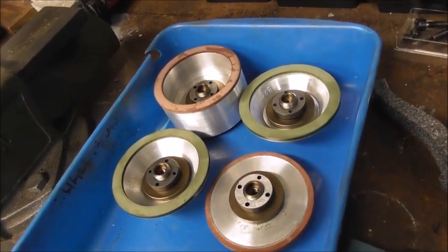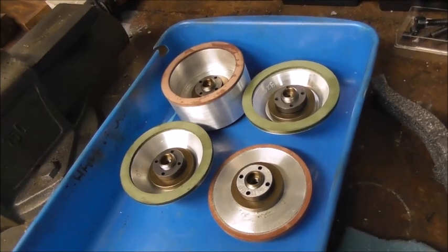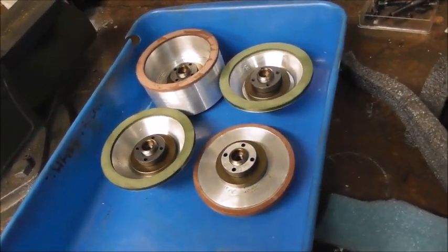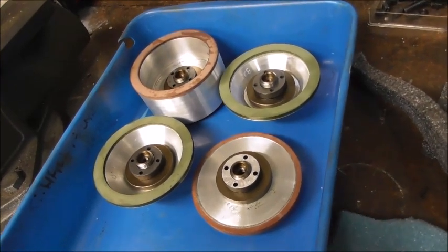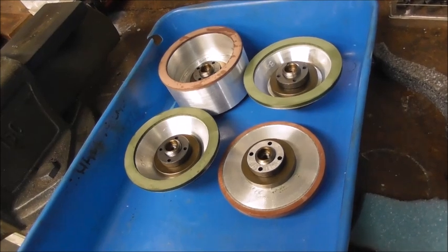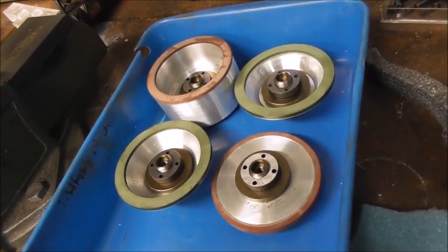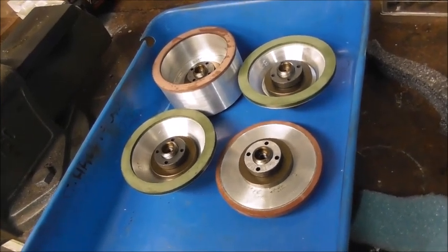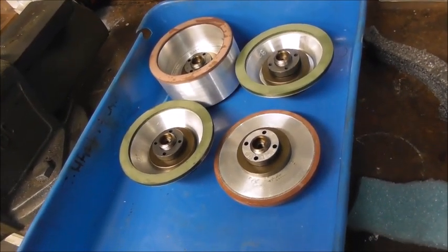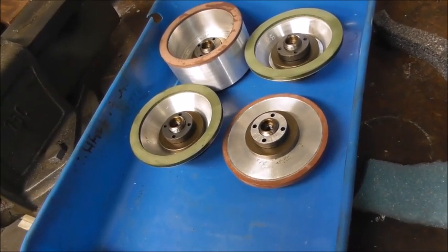I started studying different ways to dress the wheels to fix this problem. There are different solutions when mounted on the grinder — using stones and special grades of metal to strip the wheels down, clean them up, and improve them. I found that partially worked but didn't work well enough to completely refurbish badly wobbling wheels, loaded-up or worn wheels. I really wanted a way to completely refurbish them.